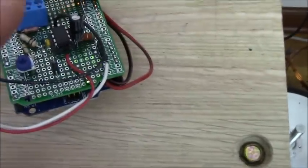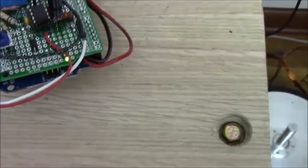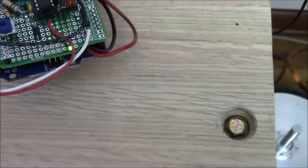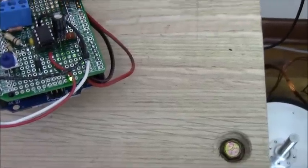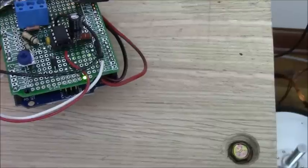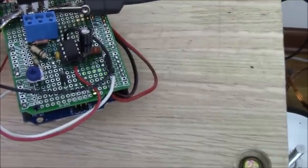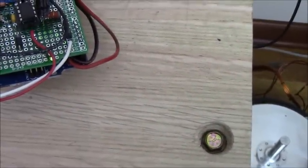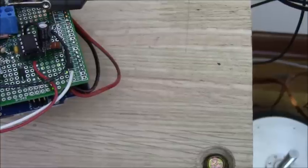So we have a gate driver here. I also have another gate driver, but the pin orientation is different, and it's faster yet than this one. But this has been a very good, robust 12 amp gate driver, so I use that on my bigger motors, these ones down here, to switch multiple FETs, at least 2 of the big FETs.